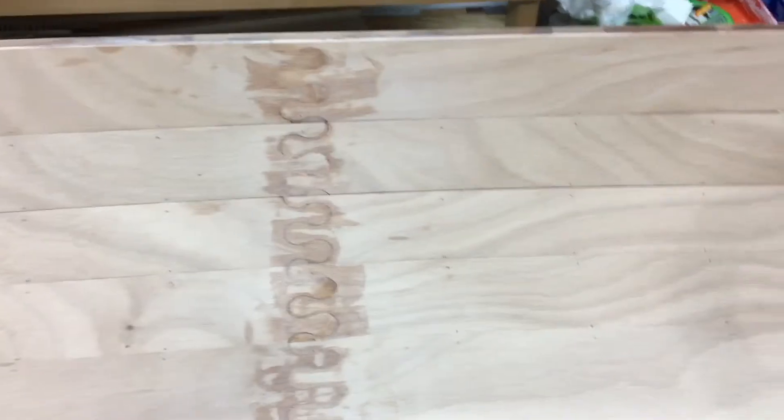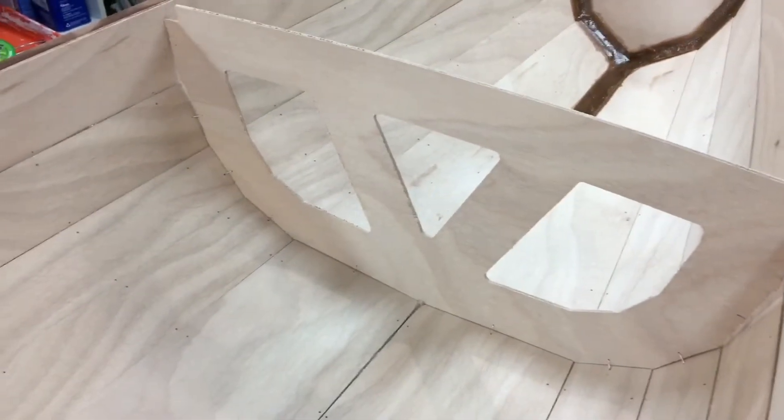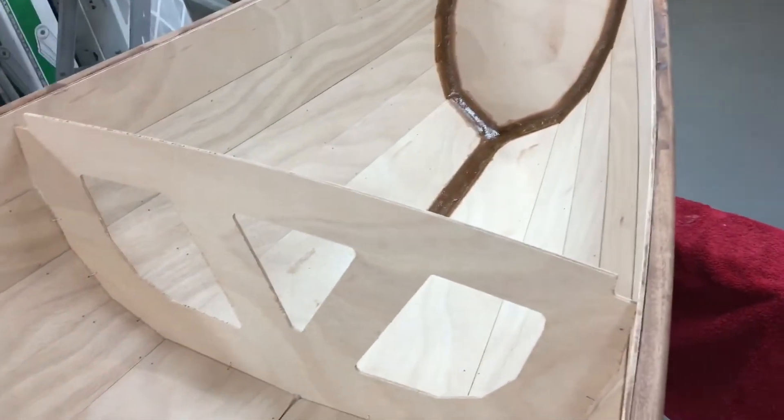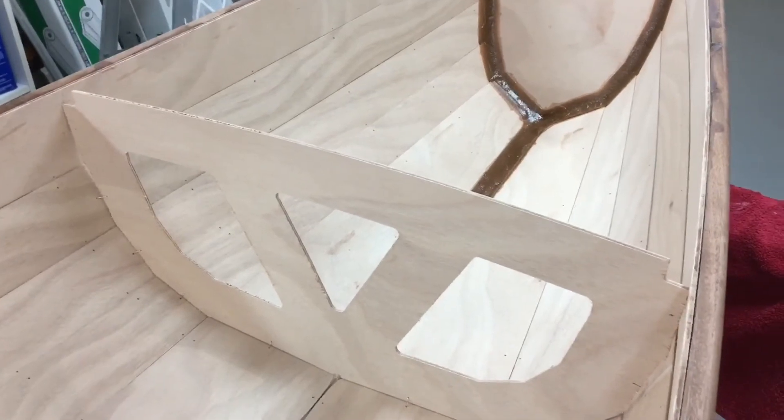I did want to show you one thing I've tried very hard to avoid. You can see right here where some resin from the outside — when the boat was upside down sealing the edges of the planks — actually came through. Even though I used quite a bit of thickener and tried to carefully seal the planks, I still got a little bit of intrusion. Here's another little spot underneath one of the temporary bulkheads. I will have to do just a little bit of sanding. When you're finishing the inside with epoxy and varnish, remember everything is going to show.